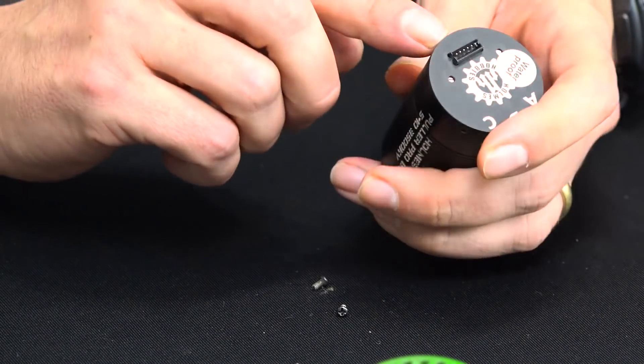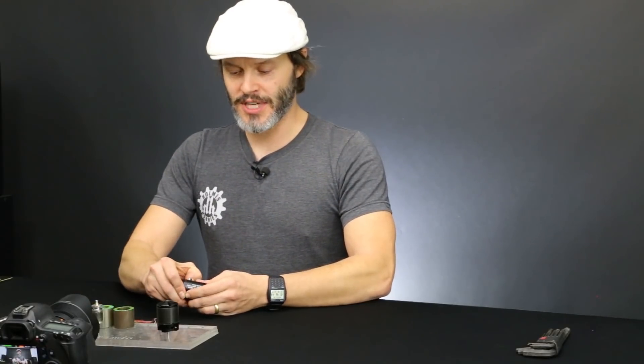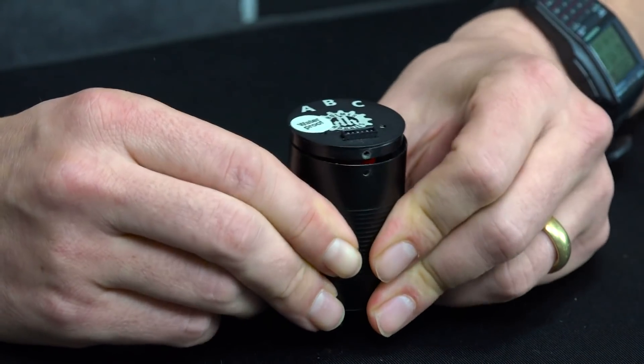I took out three Phillips head screws on the end of this motor — we usually call it the end cap, sometimes the end bell. These parts can be a little fiddly to get off. If you're taking apart a motor like the Castle Slate, it's actually glued into place and it'll take some heat to get it off. On ours, I can take this with my fingernails and pry it off, or gently push it on a table until the end slides off.